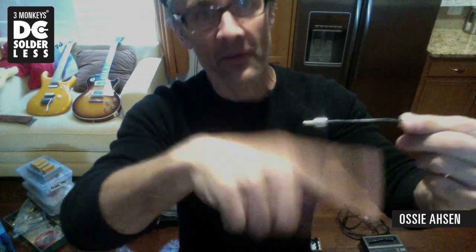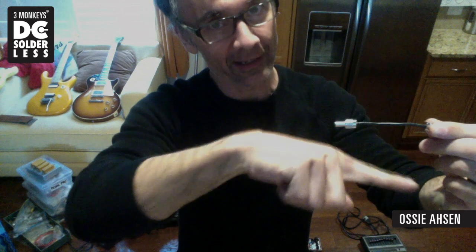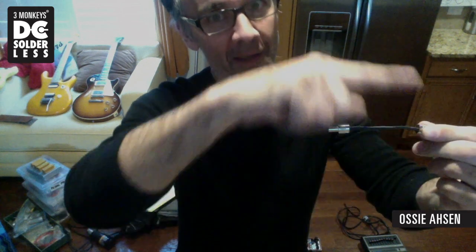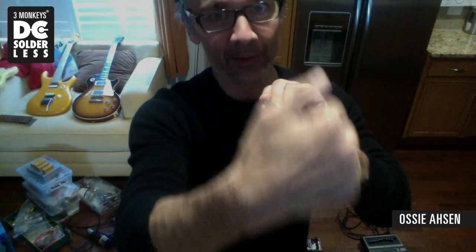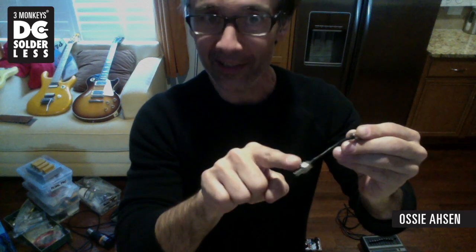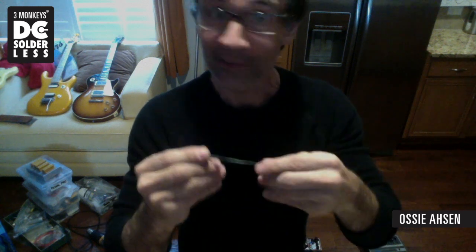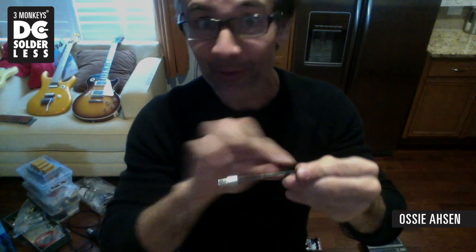Let's say you wanted to back out this thread — you would go in a counterclockwise direction, and that will back out the cable from the unit. The interesting part is on the other side of the cable, when you go to the other pole, it's now clockwise in relation to the threads. So in order for this side to back out, this side has to get tighter. And if you've done a good job tightening both sides, it's not going to go any further that way, so it can't come out this way. And that's what we mean by a torsional system, and that's why you should not worry about the cable backing out of this connector.